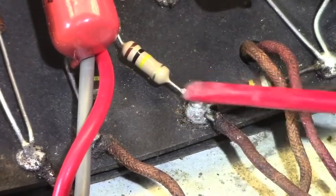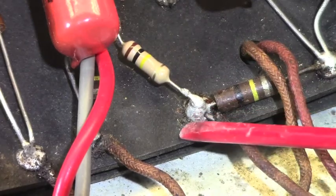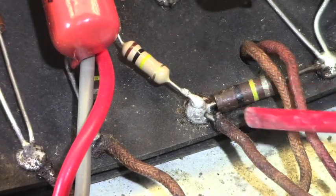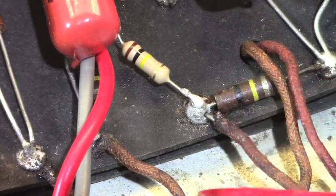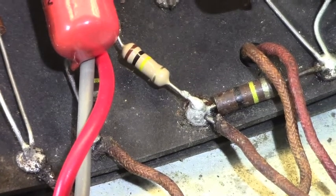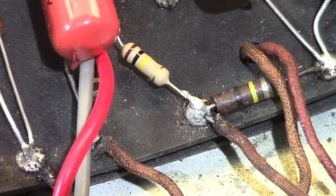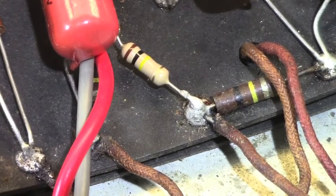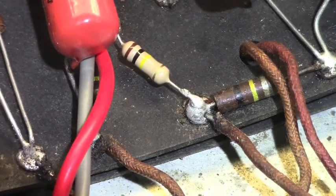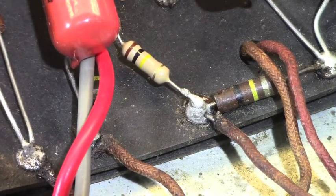That means that the work, meaning the components and the wire and the eyelet, were not hot enough to accept the solder. This is a lesson right here about soldering, okay? Soldering is not rocket science. It's not brain surgery. It requires a decent tool, and it requires some patience and care. And you want to be as clean with your work as possible. So being a bit of a neat freak does count in situations like this.